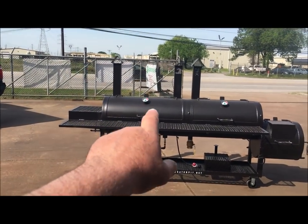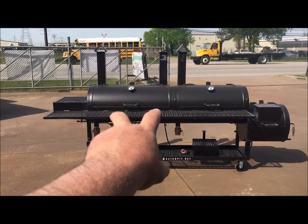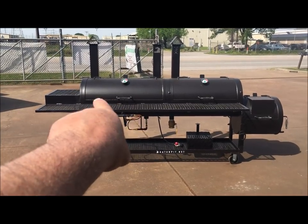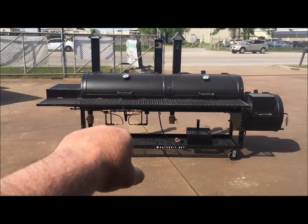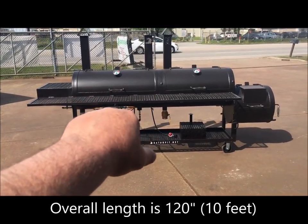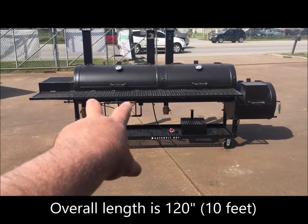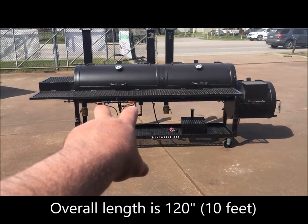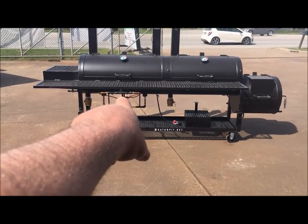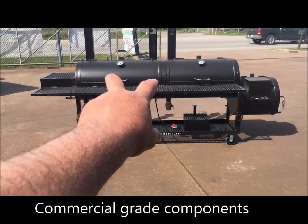Over here on the left side there is a dual cast iron H-burner — two burners on this side, 20 inches in diameter, quarter-inch thick steel, about 44 inches long on that main chamber. Again, quarter-inch, 20-inch diameter, 44 inches long, with two H-burners inside. Commercial cast H-burners and control valves outside — that's your copper and brass fittings going to half-inch pipe down the bottom into your venturi tubes and orifices that actually fire up the burners inside.